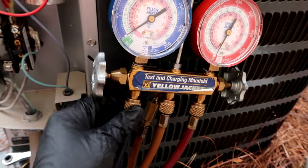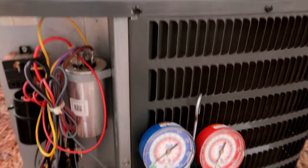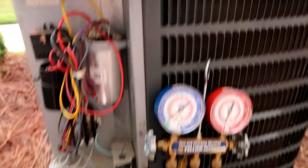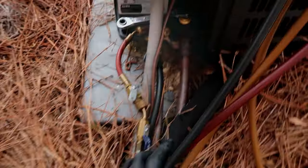That's pretty much zero - you can let a little bit of excess out, it's not enough to worry about. But all the refrigerant now is in here, so now I can go do the coil. The line set all the way up to the coil is empty. All right, we've got all the screws out of the cover.